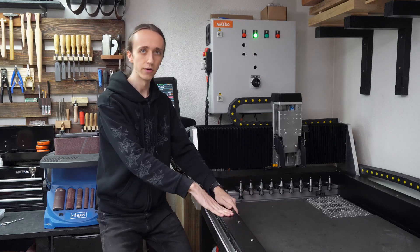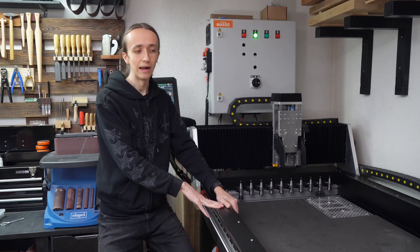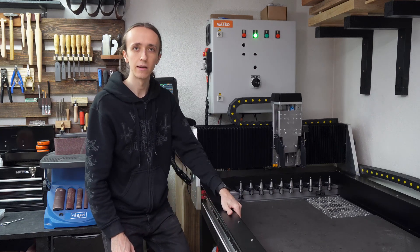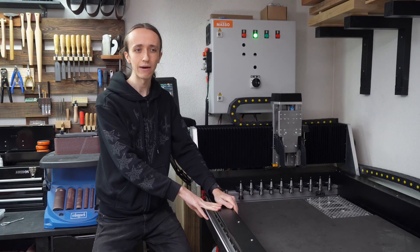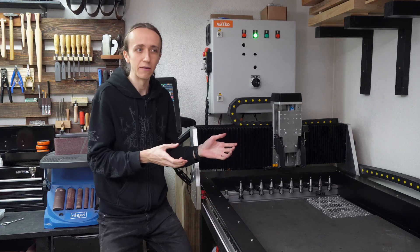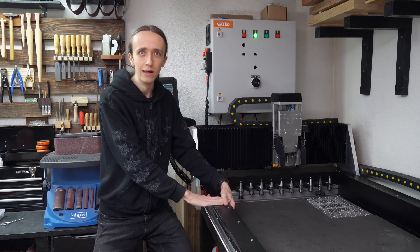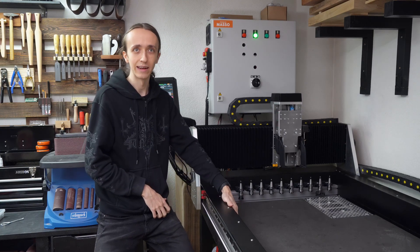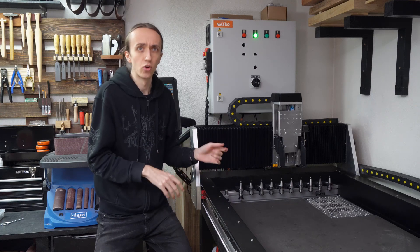Coming back to these covers — I set them up in Fusion 360, first as solid models to figure out what I want, but then I also designed the actual sheet metal parts since Fusion 360 supports that. That allows you to easily design the radius, do flanges really easily, and have it obey all the manufacturing rules. The really cool thing about PCBWay is that you don't have to submit a DXF file and manually tell them where to bend. You can just submit a 3D file, and if it's designed for sheet metal manufacturing they can automatically create the flat panel — they know exactly where to bend, to what angle, and how sharp a bend you'd like. That makes it so much easier, as with many other sheet metal suppliers you just submit flat drawings and hope they interpret your bending lines correctly.